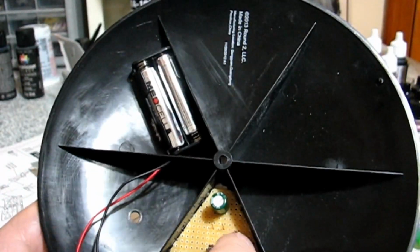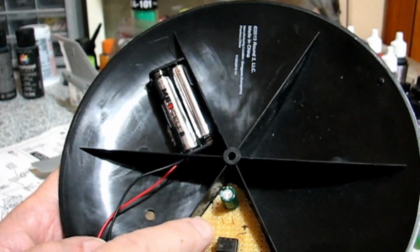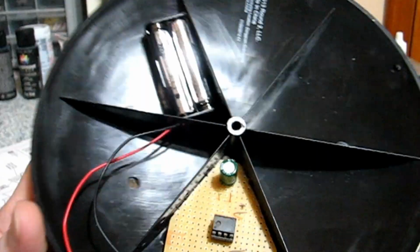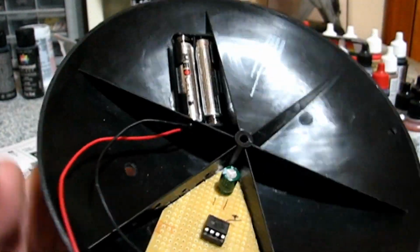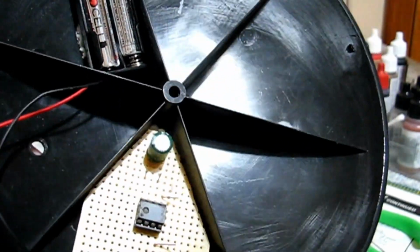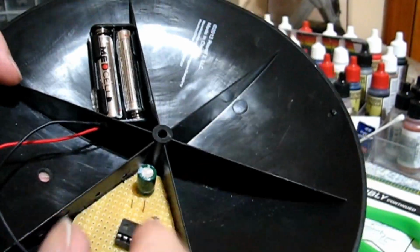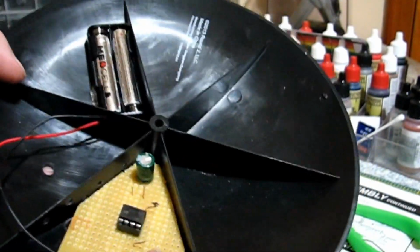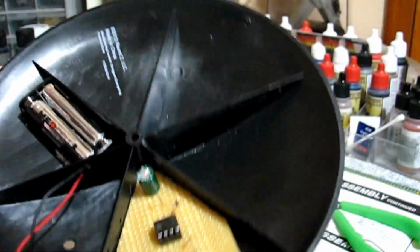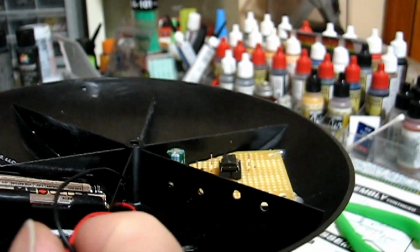These 2 legs here, which are copper wire, are the feed for the circuits, and these 2 legs over here in front of the capacitor are the feed for the strobe lights. That will make soldering them onto the board much easier, using solid copper wire as feed posts. So we're good there. We've got holes drilled into the supports underneath here for the wiring. Got different size holes in different locations. So we've got the base all ready to go.